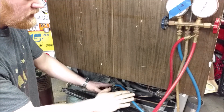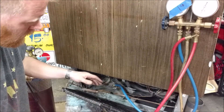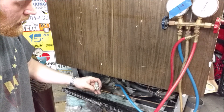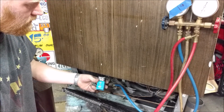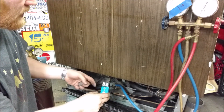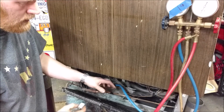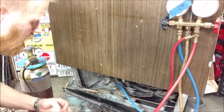The first thing you're gonna run into when you want to work on one of these systems is there's no way to hook up your gauges — there's no service ports anywhere. You can see I do have a service port on here, and I did that with what's called a line tap. These are cheap — I'll put a link below, you can get them shipped for like five bucks. This one's called a Mac adjustable line tap valve, and what it does is slide over the round line, pierce a little hole, and give you a place to actually connect a fitting.